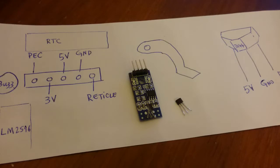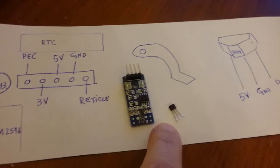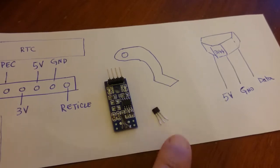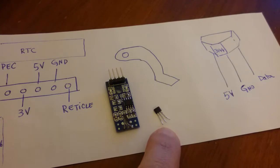The easiest way to do this — and there are many ways — is basically just a sensor that would tell OnStep that it's at position zero in the worm gear. To do this we use a Hall effect sensor, which is something that detects a magnet and would turn the signal on or off once it detects the magnet.